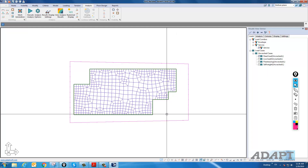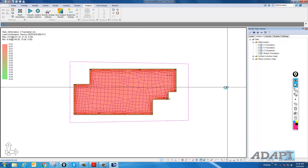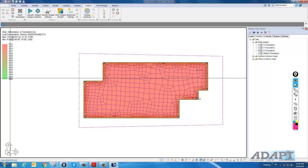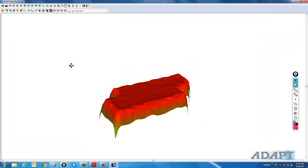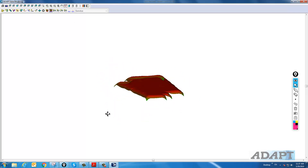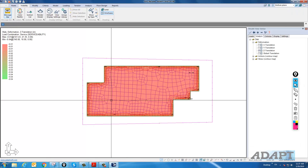Aside from the perimeter where we have a line load, we'll select the service combo under loads. Under Analysis, we'll check the Z-direction displacement — we get higher displacements on the perimeter, contour going from 0.01 to 0.04. Under the Render Model, if I go to a warped shape, this shows the deformed shape of the slab under a fully supported spring condition. We want to set the spring equal to the edge moisture distance, EM, which is typically given by a soils report.